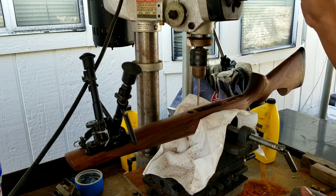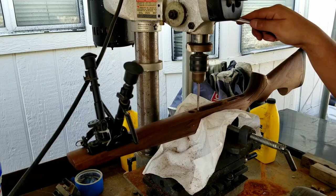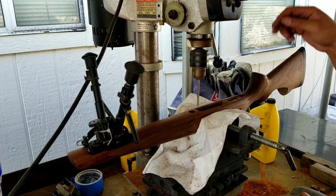So the main tool that I recommend to have clean cuts at minimum is a drill press with an X and Y vise and a 1/4 inch end mill. Of course, if you have a mill, that would be ideal. Even though I have a mill, I wanted to see if I could tackle this task using regular household tools to relate to most folks.